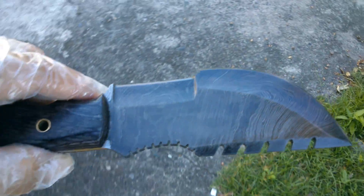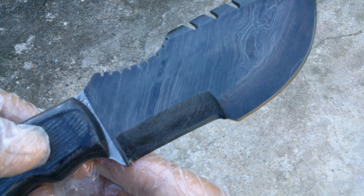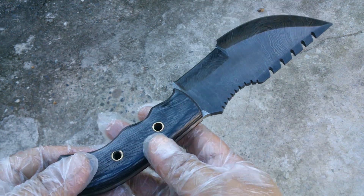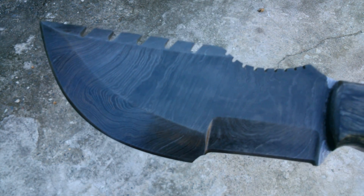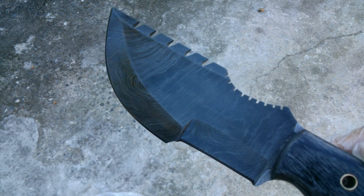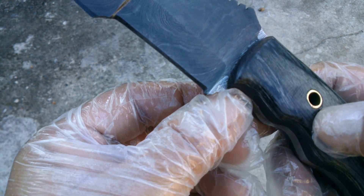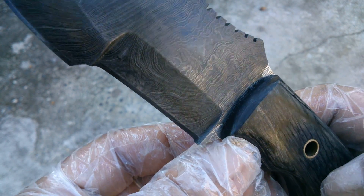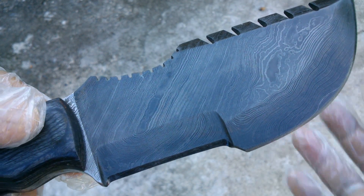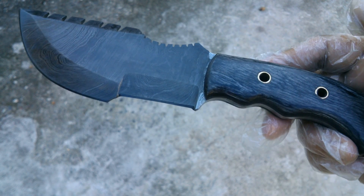Let me bring you to a nice natural light — there it is. The delineation of the white line coming into your handle — left it alone. But the black blade is looking proper now, I like it. I was very careful not to let the ferric chloride eat into the handle because that would be bad. But now the blade is black, and hopefully that would protect it from the elements and not rust.